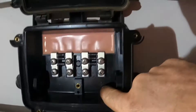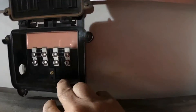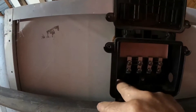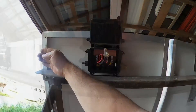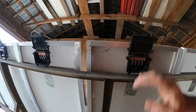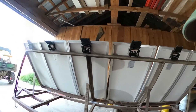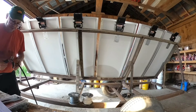That's what it looks like inside the solar panel. This is plus, this is minus. What we've got to do is hook the minus to the plus on this one, then run our plus across. We'll have our minuses come clear out to here — those will be in series. Black is hot, white is negative. I have a little bit of solar wire here so I'm going to use that.